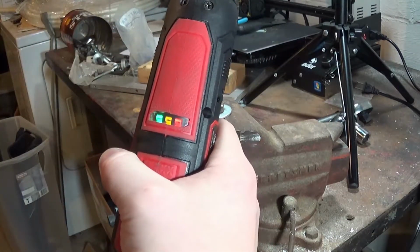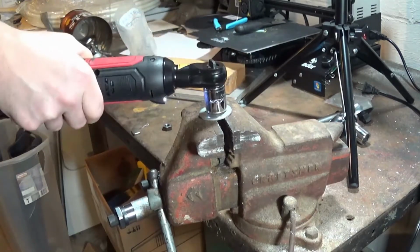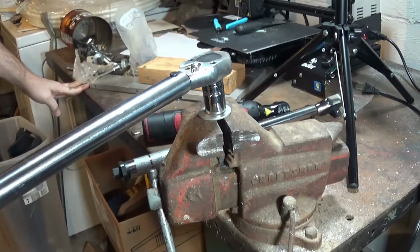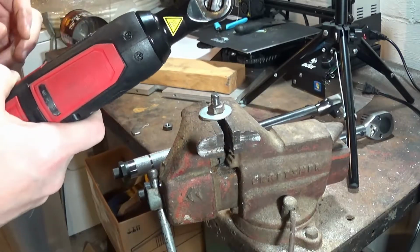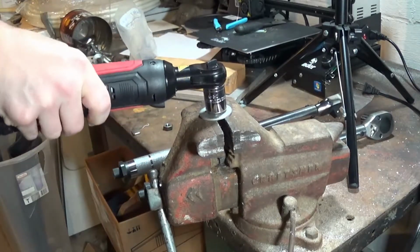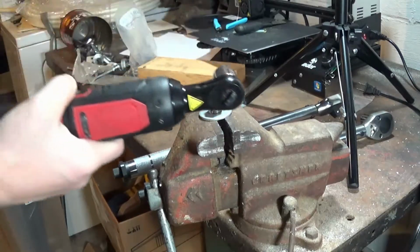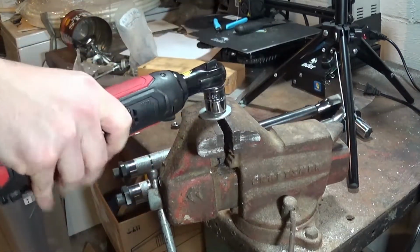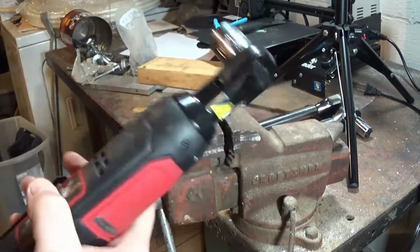And the battery is full. It's not going to be capable of 25, let's go down to, say, 22. 22, second wrench. Alright, I can do 22, but I think I kind of helped it a little. Okay, so 22 is the limit on this unit.